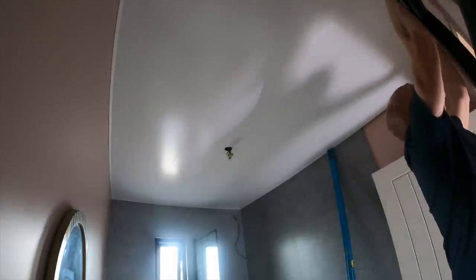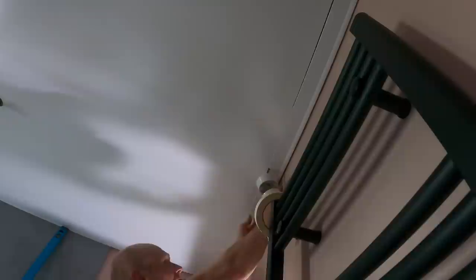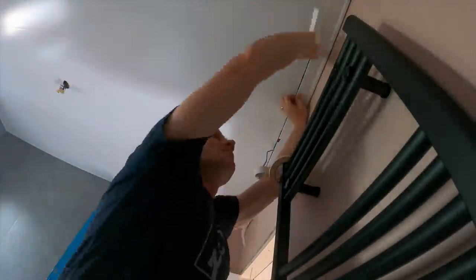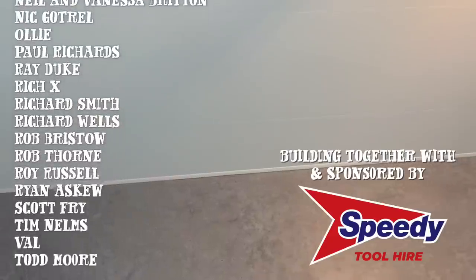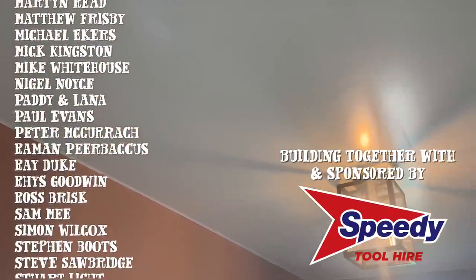With the majority of the ceiling now up it was time to turn my attention to the end trim — the frustrating little skinny bit that just had to finish off the length. I decided to run it 90 degrees to the rest of the boards and cut it so the edge of the groove just overlapped the ends of the already-installed boards, so it almost looked like it was meant to be there. With adhesive on top of the trim I masking-taped it in place to hold it until it had gone off. It's still going to need some sealant or trim where it joins the paintwork, but I think we got away with it. I would recommend using adhesive as well as the hand stapler — it went through the plastic fine into our battens. Thanks for watching everyone — we'll see you next time.